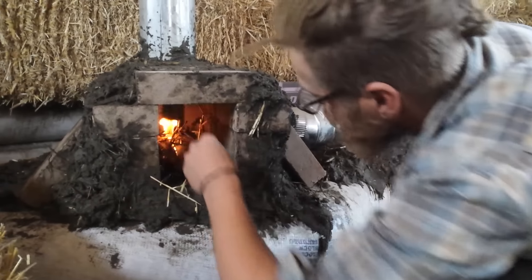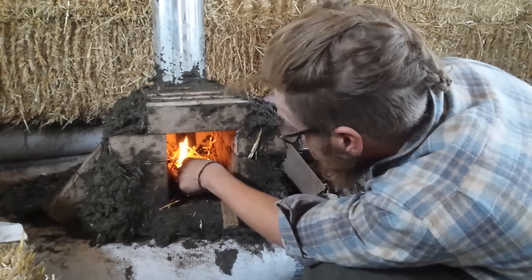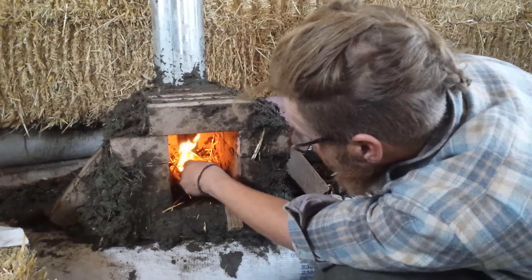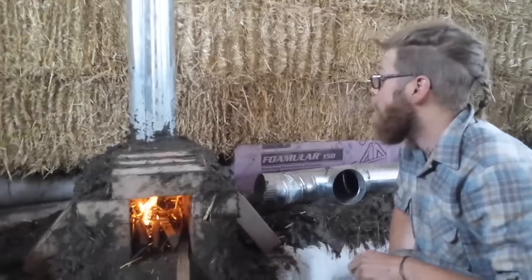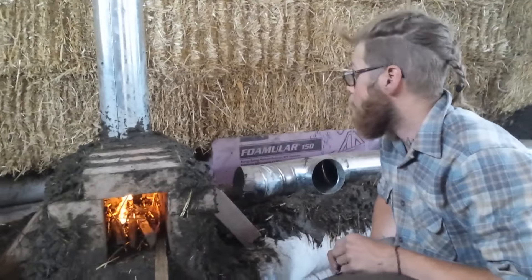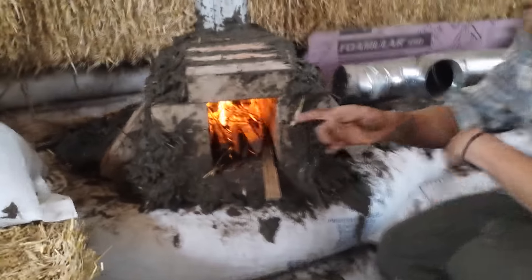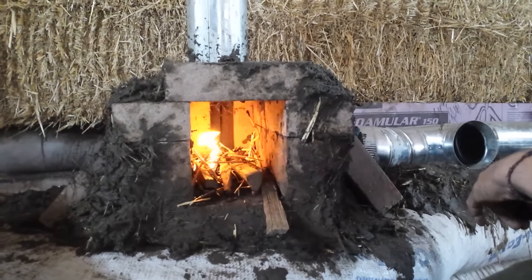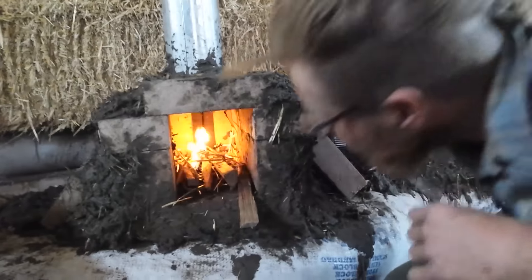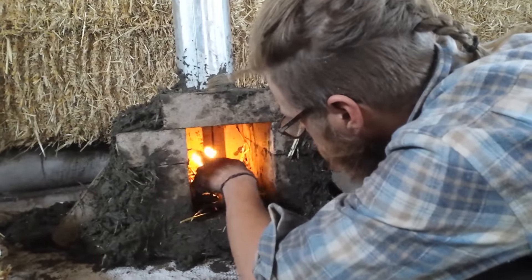Not to say I don't like J-tubes completely, but yeah. We're just testing out the burner without catching the roof on fire, mainly checking to see how well it draws with this choke — it's got a little choke in the back. I think that's one of the greatest innovations in rocket stoves; it just makes it draw so well.